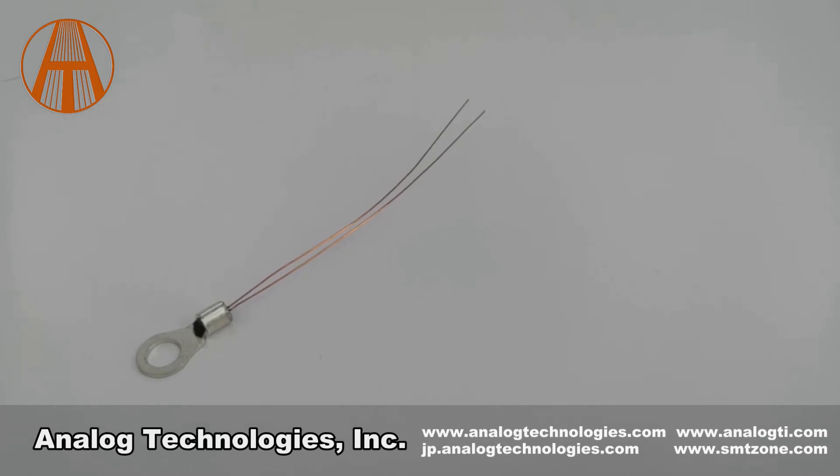The three versions are: ATH10KL2D, ATH10KL2DT70, and ATH10KL2DT70S. The ATH10KL2D has bare leads coated with copper. The ATH10KL2DT70S has leads covered by high temperature plastic tubing and sealed by epoxy, while the ATH10KL2DT70 is the non-sealed version.